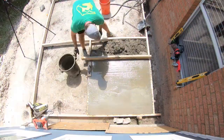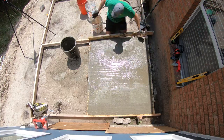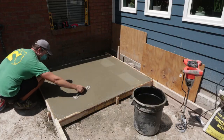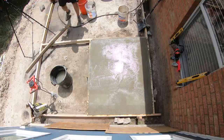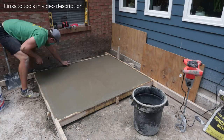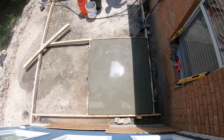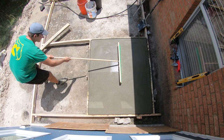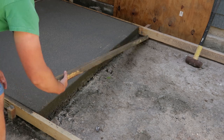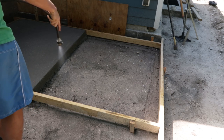Pretty straightforward — just got a rough level and filled the whole thing up, tamped it all in. Then I came back with a magnesium float to smooth it out as best I could. Once that was done, I came back over with a round-over edge tool and rounded over the corners, then came back and did a rake finish. Hours later I removed the forms, and I was moving so quickly I could start pouring the second section in the same day, which was phenomenal.